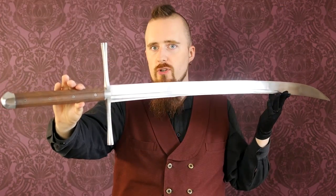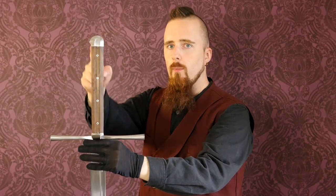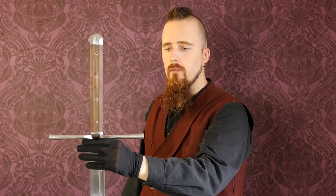Forging versus stock removal — both have their pros and cons; neither is inherently better than the other. The guard and pommel cap were cast in mild steel, and the guard has this additional lug on the side which in German was called a Nagel, literally translating to 'nail,' attached with a rivet. The purpose of this is to protect the knuckles as you're holding it, making them less available as a target, and it also allows you to catch the opponent's blade on the flat without fear of the blade sliding down and cutting your hand.